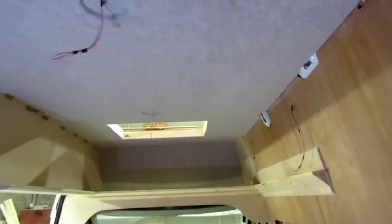Doing a flat roof like this should be straightforward, but especially with the four-way stretch stuff, if you get an ever so slight kink as you're rubbing it through, you can get creases in it, so you've got to be really careful. That's why I got Chris to give me a lift with it, with it being such a big piece. But that's done now.